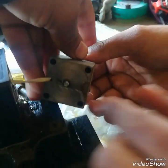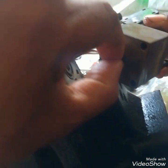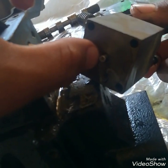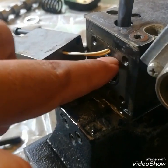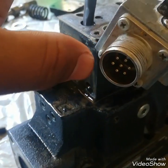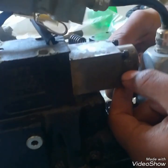I have removed it. Here you can see a pin that moves with the magnet of the coil — it's just like an SOV. So it moves the spindle left or right. We have to clean this pin and we also need to clean the spool inside.